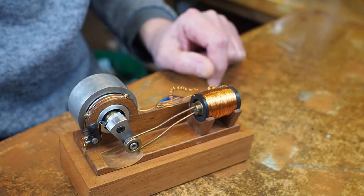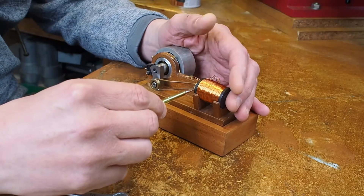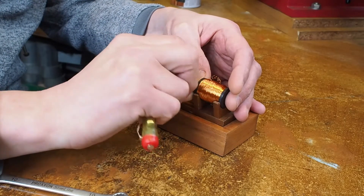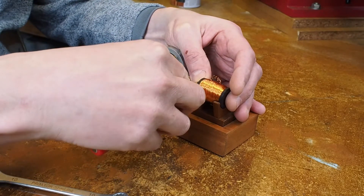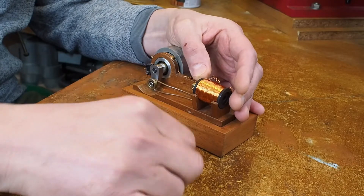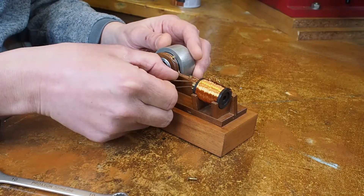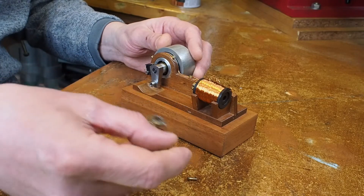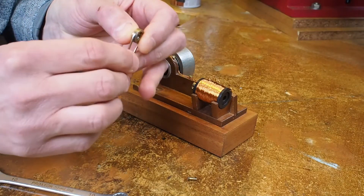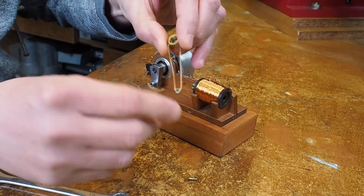Let's take it apart and see where we get to. First of all, we just take off this — this is effectively the gudgeon pin. So this little bolt in the top here is the gudgeon pin. If I just unscrew that — it's a little brass bolt. You can see it's got a plain section on it which is good; it means it runs nice and smoothly. Then I can pull out the connecting rod, and you can see there are tiny little 6mm internal, 10mm outside ball race bearings. Really simple connecting rod — just a piece of bent wire and a bearing each end.